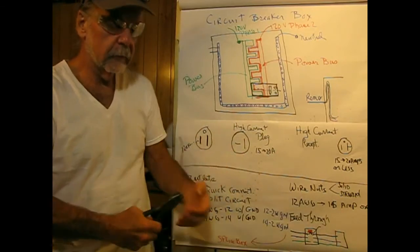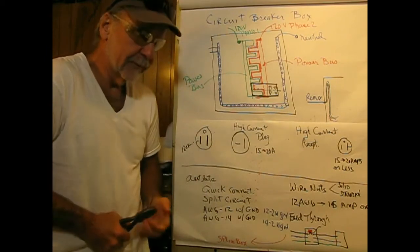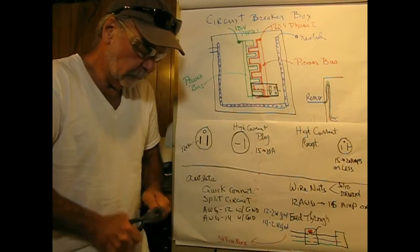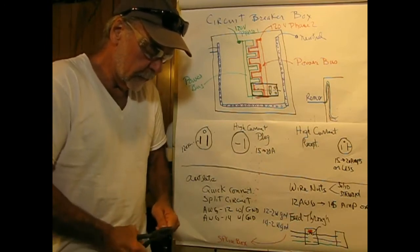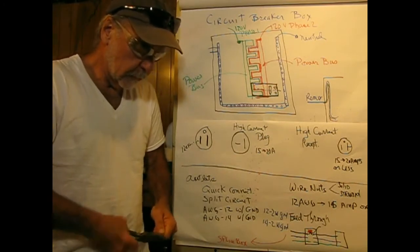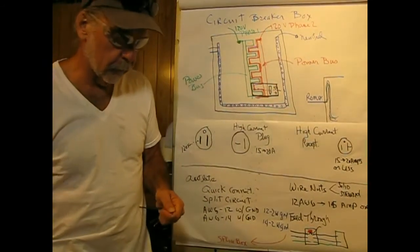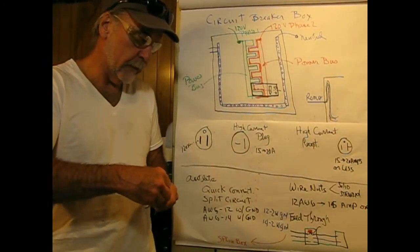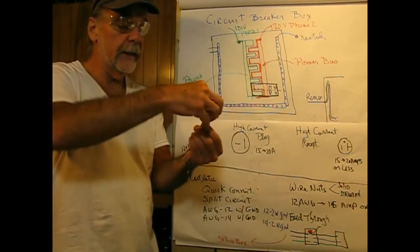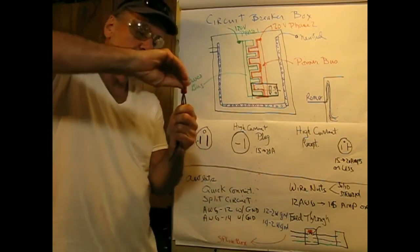and shielding other people in the room. These are kind of old cutters, so get it cut through here. I didn't intend for this to happen, but there we go. Cut too many steel bolts with that. Then you have your three twisted together, and you put your wire nut on, and what you're guaranteed is that the ends are all the same length. So you don't have that one wire pushing up on the top.